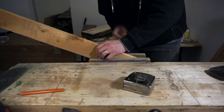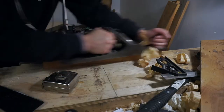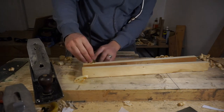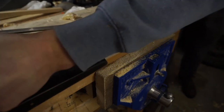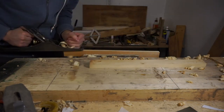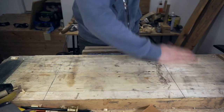I decided to use different wood and keep going with the same basic idea. I grab another piece, cut it to rough size, then get it in the vise to rip cut it — which took quite a while, but thanks to the magic of editing, there we go. Then I plane one side flat to reference the marking gauge, ensuring consistent width for both legs. I mark them up, put them both in the vise, and plane them down to their final size — going quickly at first, then slowing down as I approach the final dimension. Then face planing to make sure all four sides are smooth, eliminating the need for sanding later.